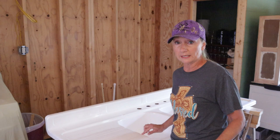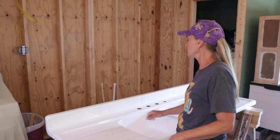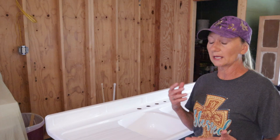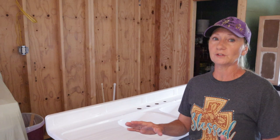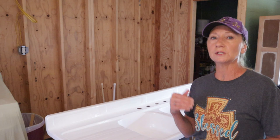I did notice that anywhere you have a drop-down — such as on your drain board, and these sinks have several drop-downs in different places — my product ended up a little bit thick there because I didn't push enough out. When you're rolling, you're not rolling the product on like paint — you're using the roller to help push the product. You can also use a plastic scraper, and I did use both. If you watch their videos, those are phenomenal and I highly recommend them. I'll leave links in the description box below.